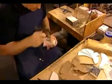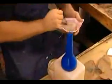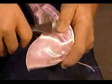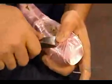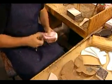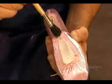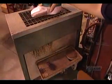After letting the toe box dry for 24 hours, they glue the lining over it with contact cement. They trim off the excess, then glue the satin over the lining, forming delicate pleats. They use lighter glue this time because contact cement would stain the fabric. They apply a foam filler to even out the shoe's underside, then coat it with high-strength vinyl glue. They apply the same glue to a sole, then leave both to air dry.